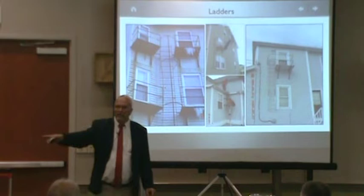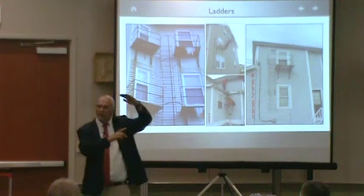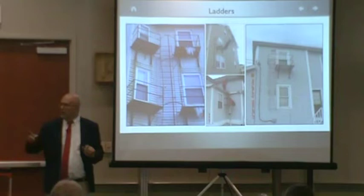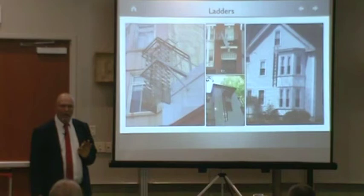That is this balcony. That is this ladder. As you can see, it's a little bit more than 6'8". So the question now still becomes, do we extend until we hit the minimum of 6'8"? Because I'm going to have to go back and do my research to find out where I read the word 9 feet, because that's what I find a lot of them are, 9 feet. So that ladder, that balcony, and the brackets on that one are 1.5 inch by 3/16 on average, if not 1/8 on the brackets. Metal ones are a minimum of 2 by 2 by 1/4 thick.